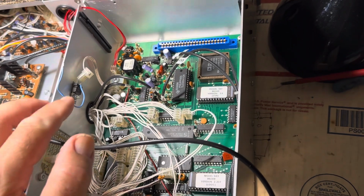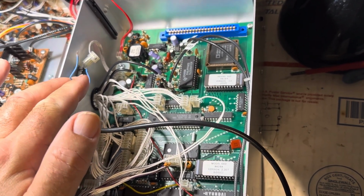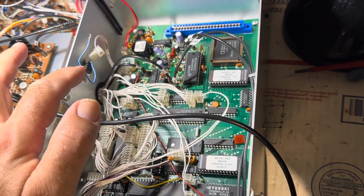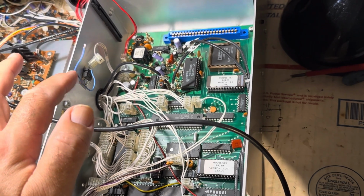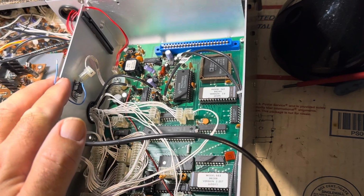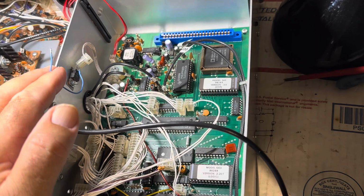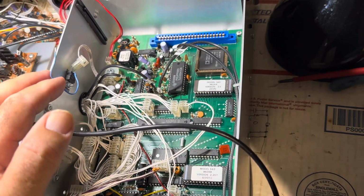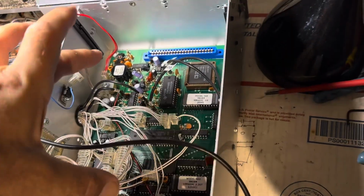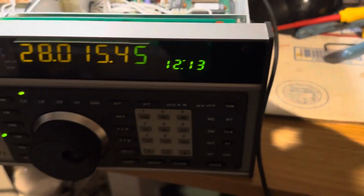And they run this thing at like 5.6, 5.7 volts. They kind of fake the ground here and have like a diode in series, so that actually the regulator is putting out 5.6 volts. I'm not sure why they do that. I basically was grounding the middle lead to give it exactly 5 volts out, thinking something in here was overheating. That didn't do any good. So I finally pulled the CPU board out, this whole board out, and simply resoldered the heck out of the bottom of it.